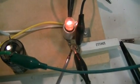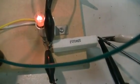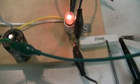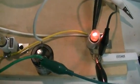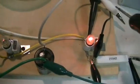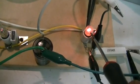Our scope probe placement goes as such. I have the two grounds of the scope leads between the incandescent bulb and our CVR. The blue channel is on the front side of the CVR. The yellow channel is on the other side of the bulb. I've set it up this way purely because we can see the current flowing through the system — which means it's flowing through our incandescent bulb, which is just a resistor. The yellow channel is across the bulb so it can read the voltage across the bulb at all times.